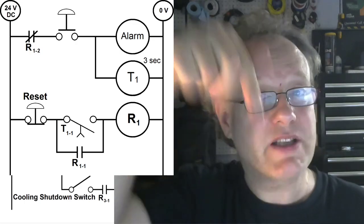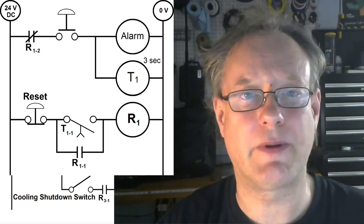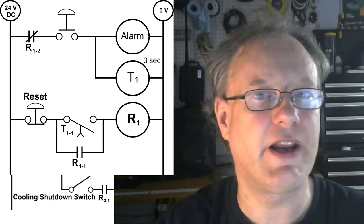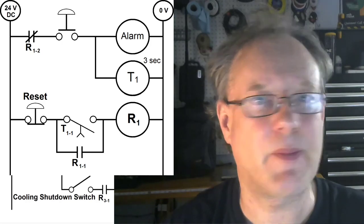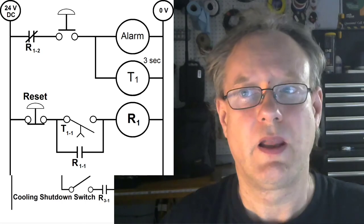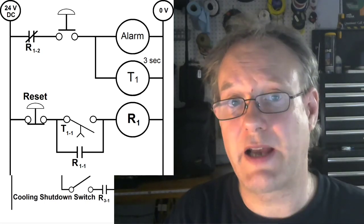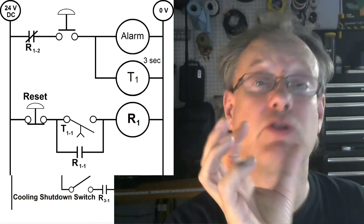So now I've got sustained closure. If someone presses the button, that horn or that beeper or whatever, the alarm is not going to sound. It's not going to happen. So Buddy's fired. But maybe someone can come along and say, well, okay, we've done some training with you, and the training is, dude, you can't do that anymore. You can't hold that button down for more than 3 seconds. It's not allowed. Next time that happens, it'll be shut down and you won't be allowed to operate the button anymore. So then a reset is required. So we put a reset in. Now the reset is going to be the termination contact that terminates the memory latch around the counter contact.